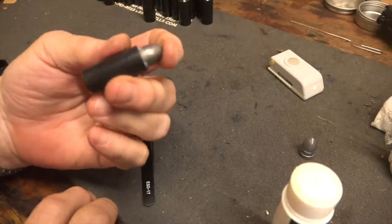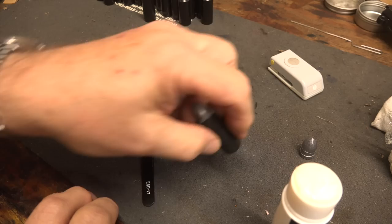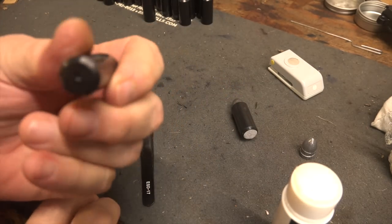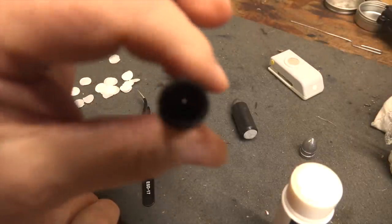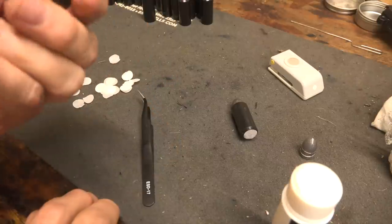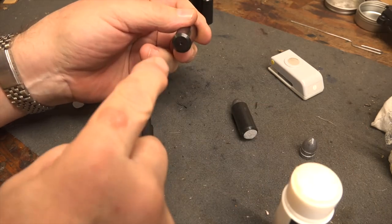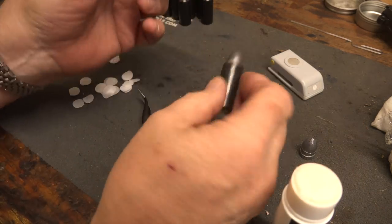This is a completed Smith carbine cartridge — kind of interesting. The cartridge case was made out of India rubber, and these days we use this plastic. You can see it's got a hole in the back. Basically, the cap goes off, sending a jet of flame through that, next to powder, and blows a bullet out of here.